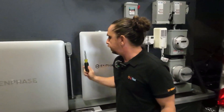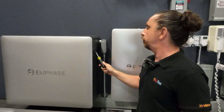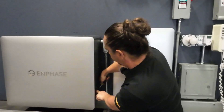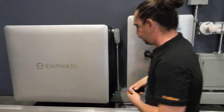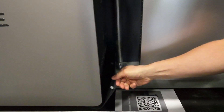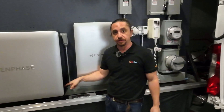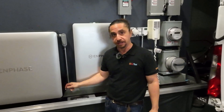The other tip is you should never install your conduits too close to your cover so that you're not able to open the doors to the cover. It has these side doors so that you can access a couple pieces of information — you'll see some serial numbers down there, and there are some dongles down there. You want to be able to access this, but if you install your conduits too close, you won't be able to.